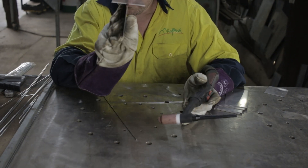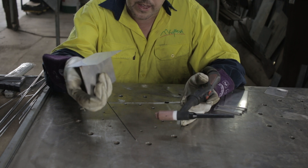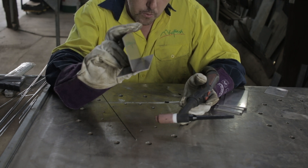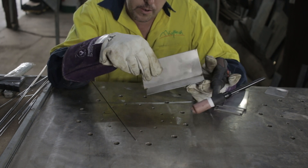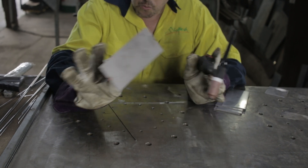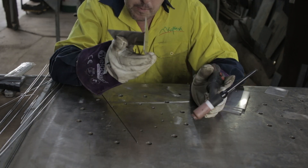Today I'm really going to focus on the power of pulse. This is the game changer, particularly for stainless steel — this is 1.5mm. Don't ask me what that is in banana units. This has terrible thermal conductivity; it really holds the heat in one spot. If this was aluminium and I welded down here, I would be getting burnt at the opposite end, because aluminium is a great conductor of heat, and stainless steel is the exact opposite. Of all the materials you'll ever weld, stainless steel is the worst — it will bow, it will buckle, because the heat just stays in one spot and it expands and contracts.